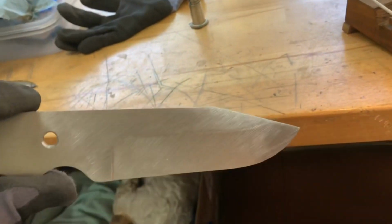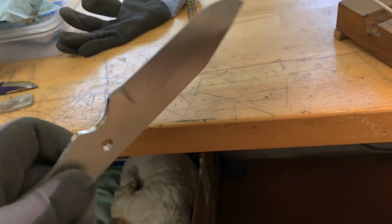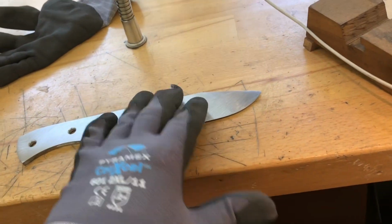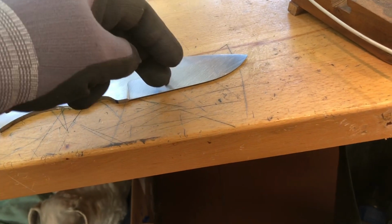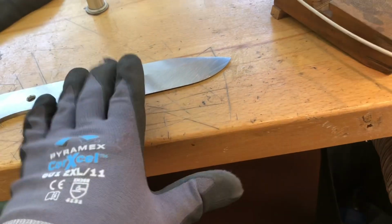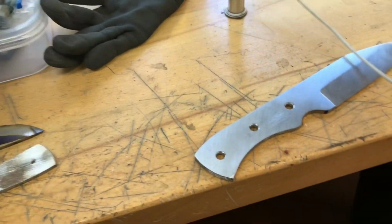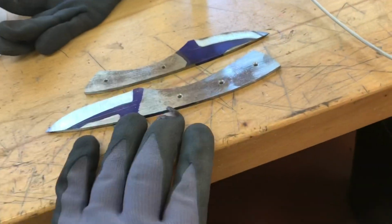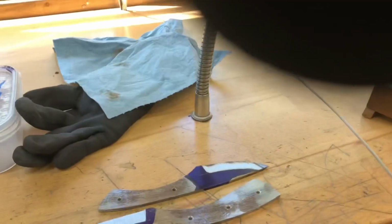All right, this is North Country 32s. This is getting a stone wash finish. That is sanded up to 120 right there. I've got all the grind lines sanded out. Now I start sanding the previous grit out. From this point on, it gets a little easier sanding. And next, I'm going to do Mike's 2 knives, but after doing that, I realized when I grind the flats on my 6x48,